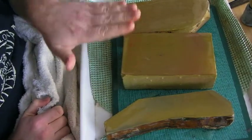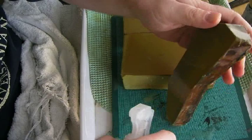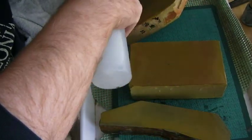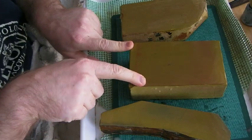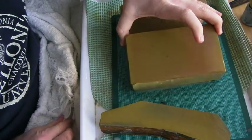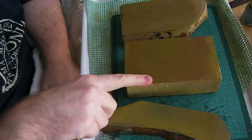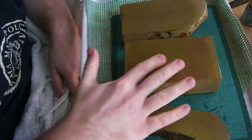Now I've established this stone is very soft, this one medium, and this one very hard. At that point, what I want to do is test how the stone interacts with blades. One thing I should mention: whenever you're doing this, you should always look for inclusions — bad things in the stone other than the stone itself. This stone right here actually does have some inclusions. You'll see there's a black spot here, here, and here. That's definitely something you want to watch out for. If you're honing and you feel anything — any kind of tick or catch whenever you move your razor or knife over that point — bad sign. I've used this stone several times and noticed nothing like that, so it's okay.